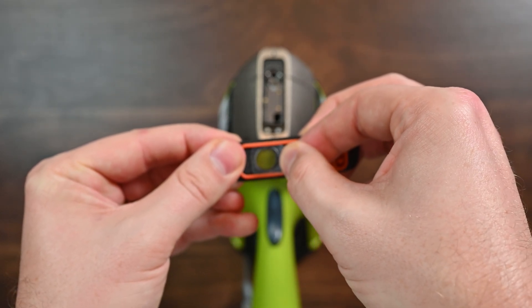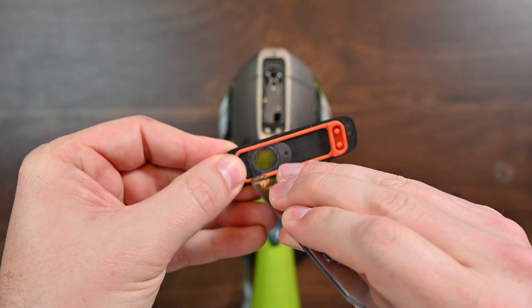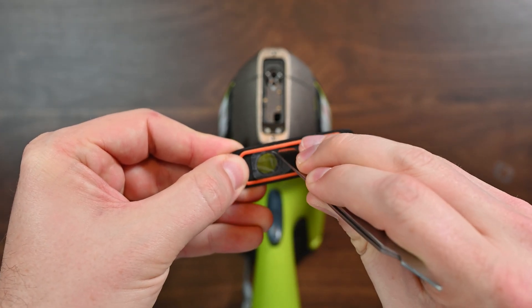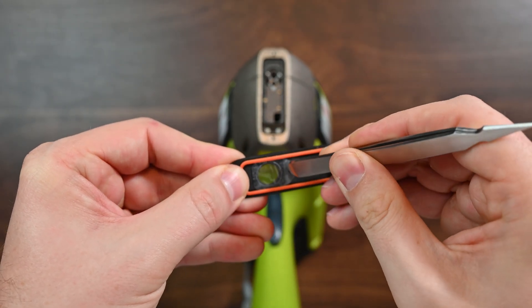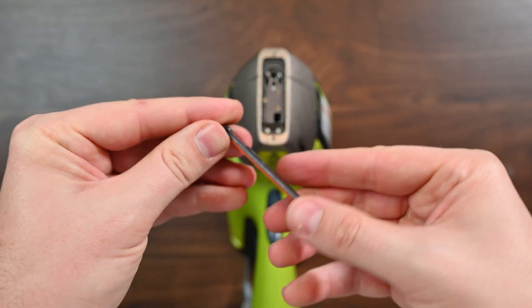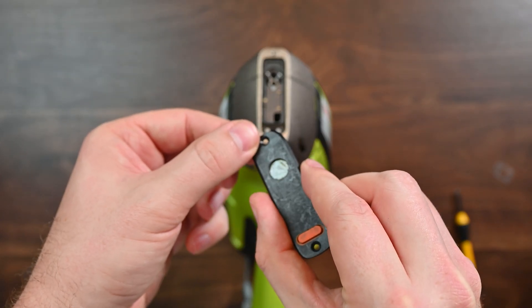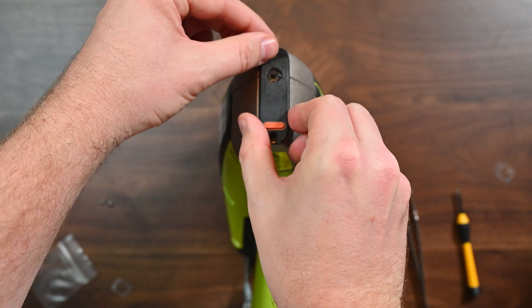Then I'm just going to press the window down. This is a pressure-sensitive adhesive, so I'm using the back side of the tweezers right on the edge. You don't want to touch the center of the window at all — they're pretty delicate, but they're delicate for a reason. They allow most of the x-rays to pass through, and you can see in the light there that the window is brand new and clean.